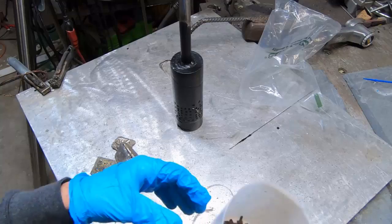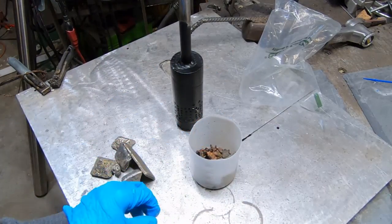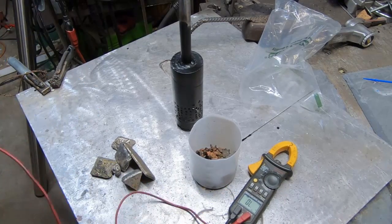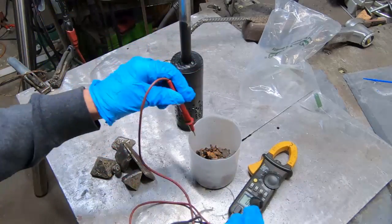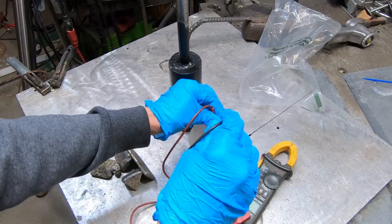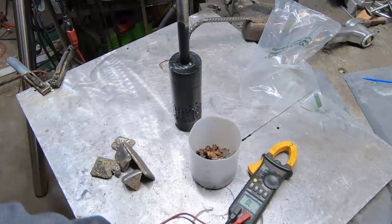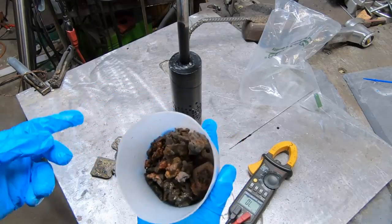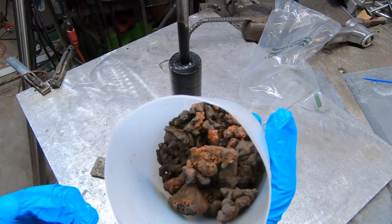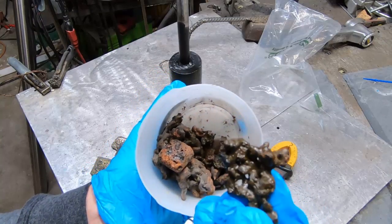If you're not careful, the material can passivate. Right now it's okay, and I just wanted to show you that with an ohmmeter that I have here, set to signal. As you can see, if I go from one side to the other inside of this container, I get continuity, which is important. There are certain parameters inside the cell that must be maintained to continue that continuity throughout this pile of e-waste scrap that I have poured into shot.